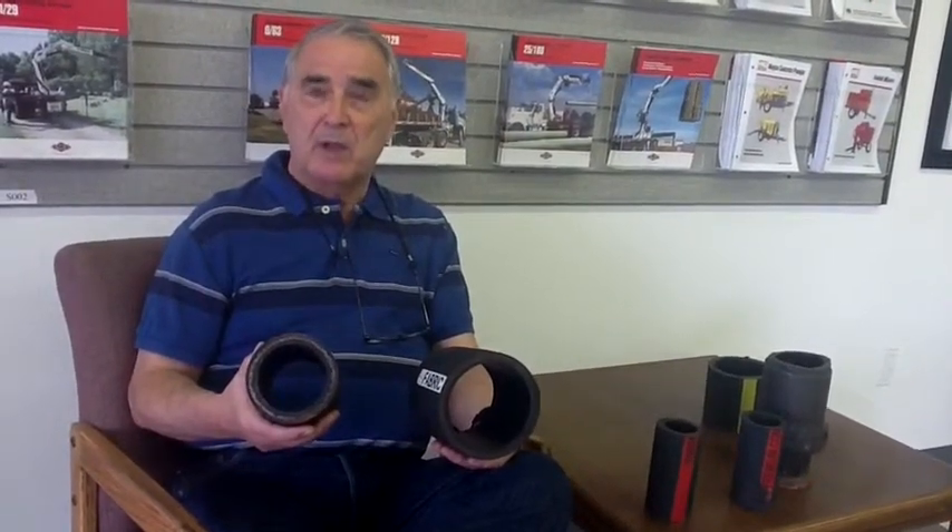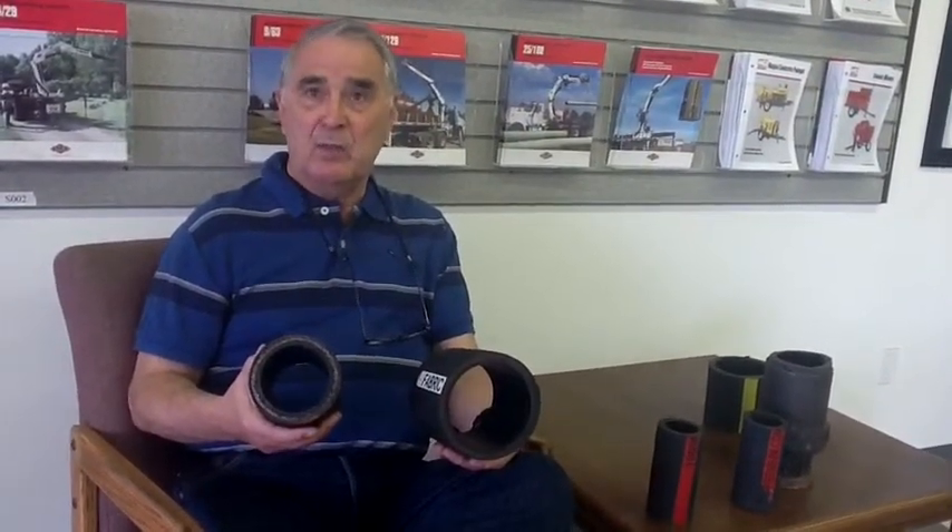Please take special notice. You see one hose here has what they call a wire mesh. This wire mesh is used for pumping high rises and used in concrete boom pumps. Then you see in my left hand a wire fabric graded hose, six ply. This is used in the Latin American countries because they pump a larger aggregate than we do, and they use a much harsher aggregate.